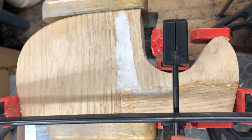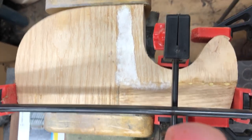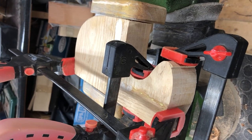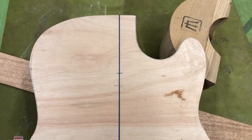I didn't have enough stock big enough to do it in one piece - I must have ten or fifteen of these blocks just knocking around - so I glued a few together, bandsawed out the shape, and cut it slightly small around the bits where I know the sides are going to go on.